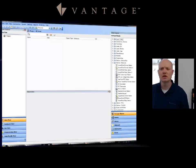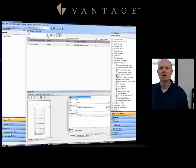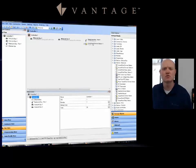Let's take a look at Design Center. I'll come over to a scene point dimmer station, double-click on that, and bring it into the file. Notice it looks identical to any station — low voltage keypad or regular scene point dimmer, wired or Radio Link. Under bus view on the left-hand side, once I've added one scene point dimmer that is Radio Link, it will automatically add a Radio Link enabler antenna on the first available port.